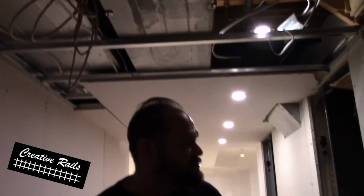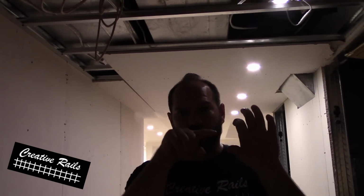The problem, what they say, is when you have insulation between those studs, because of that space, when the screw goes through the vapor barrier and into a cold space, it causes cold air to come through, which will eventually cause your screw to rust. I've personally never seen this. I've never seen it in a commercial application or in a basement, but that's what they say. But in this situation, it doesn't matter because I've framed in front with the minimum code insulation that's already on the walls.